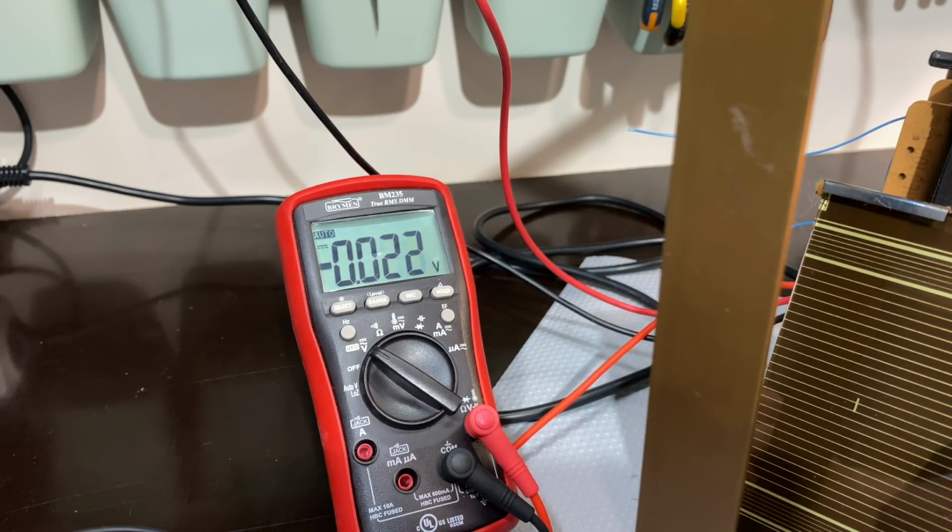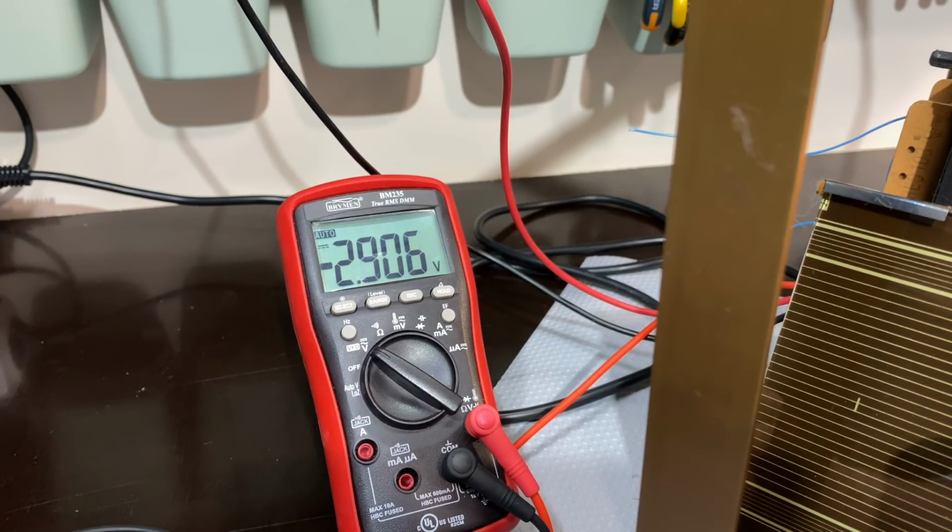Let it warm up. Yeah, we can hear it, and it's a negative voltage. Whoa, they want minus 12 volts on there. That's going to be very loud. I don't need the volume because this thing's before the volume control, but what happens if I put off modulation? I see. Our modulation gives us a higher voltage, and I think that's good enough. They don't tell us to put off the modulation, but let's see what happens.